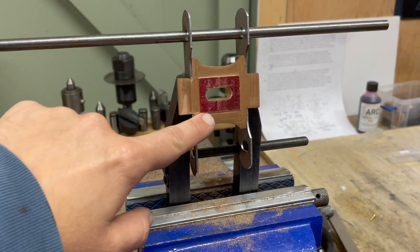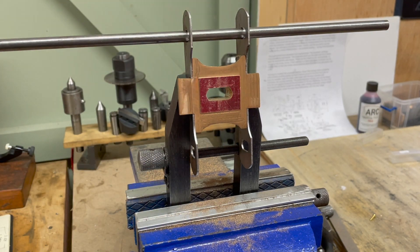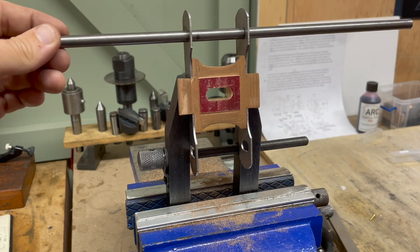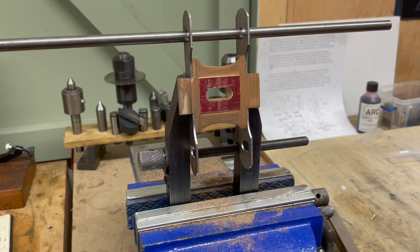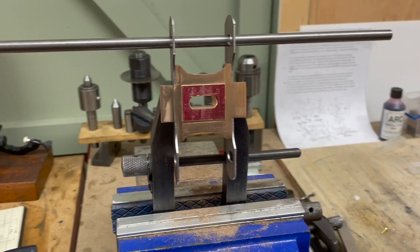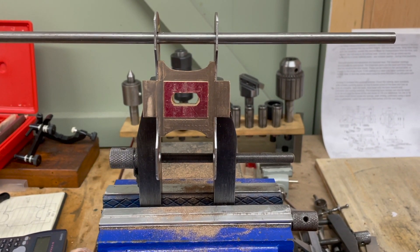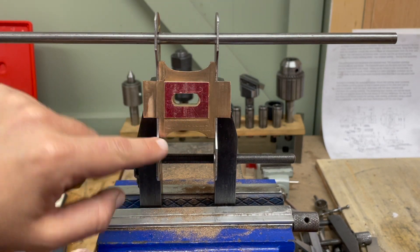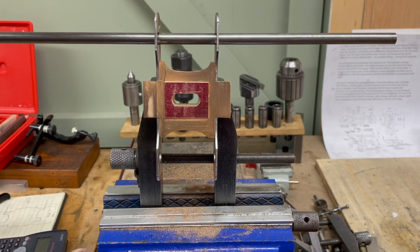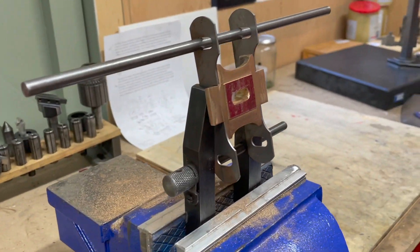Anyway, with that said, let's get on with the machining. What you can see here is the bogey stretcher and the two steel bogey frames, and this is just a piece of rod I've stuck in this little slot just to confirm that they are indeed parallel — and it's a nice fit. I'm really pleased they're quite straight and in line with each other; there's no bow-leggedness. I was a little concerned, but what it turned out was there was a burr on the inside faces here which was pushing the top out and the bottom in, but as you can see it's nice and straight.